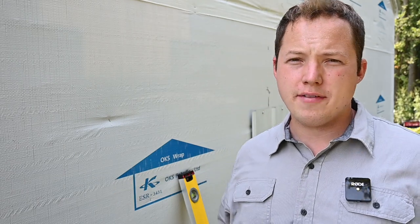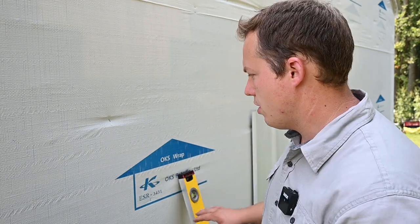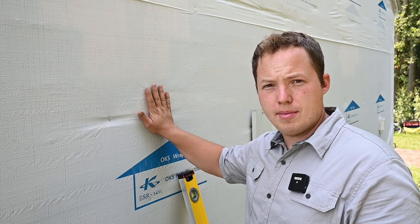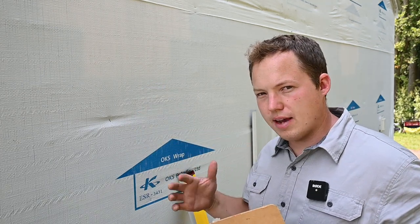A couple other things about mounting it to a wall are that you need to be aware of the fact that there's going to be some sound transfer. Basically, you have a compressor and fan motor in that outside condensing unit that creates some vibration. So when you have brackets that are attached to the framing of the building, that is going to allow that compressor vibration to transfer through the wall at least a little bit.